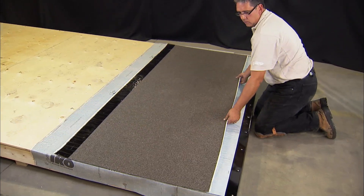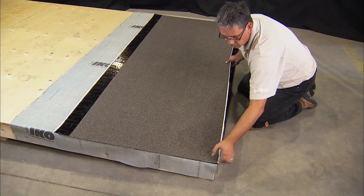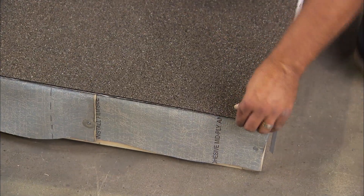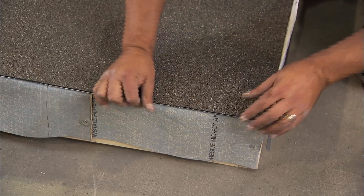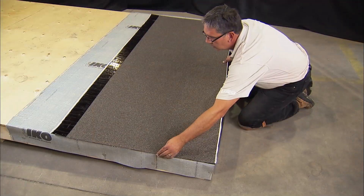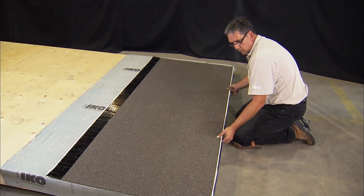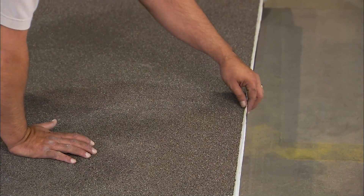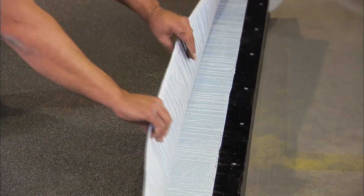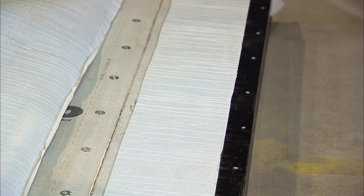To apply the cap sheet, start at the lowest point of the roof and roll out the full width RoofFast cap sheet. Cut to the desired length, dry fit to the roof edge in the final position, and allow to relax. Make sure the 3.5 inch side lap on the RoofFast Cap is opposite — furthest away — from the drip edge metal flashing. Using the butterfly technique, while kneeling on the upper half of the positioned cap sheet, fold back half of the width towards you to expose the release film.